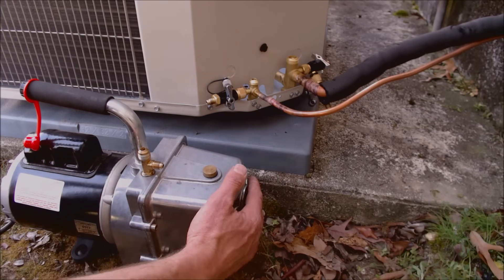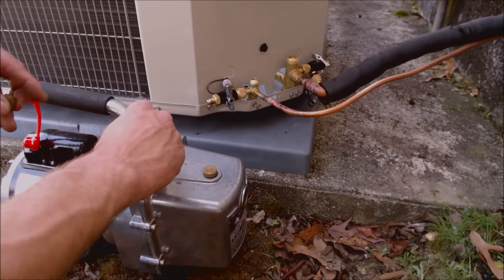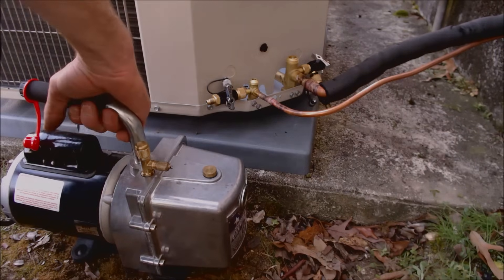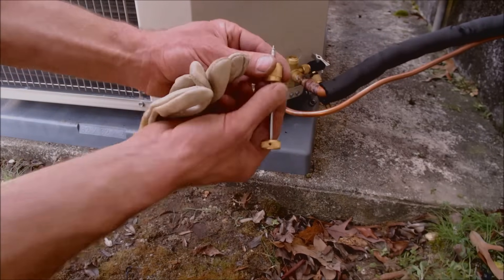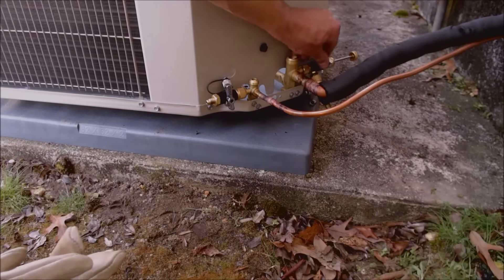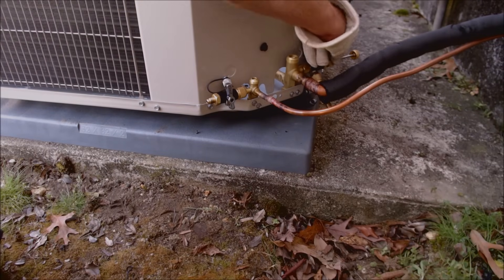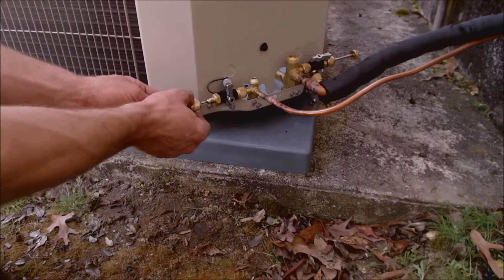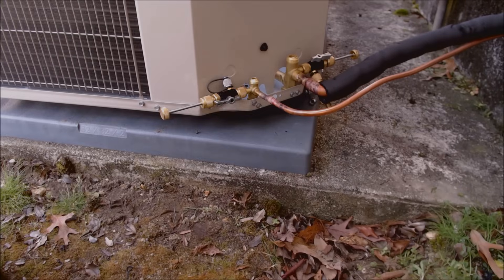You have less vacuum pump wear and tear when you do a vacuum like this — this pump isn't even warm. What I typically do is screw the caps on but not all the way; I'll tighten them fully later. Now to put the valve cores back in — you just have the valve core on the end, push this forward, and screw it in. Now we have positive pressure, so that's going to push it out. What I like to do is just purge any air right here. Same thing on the other port — put this in, positive pressure, purge a little bit of air out.